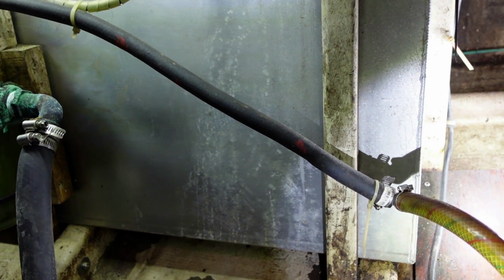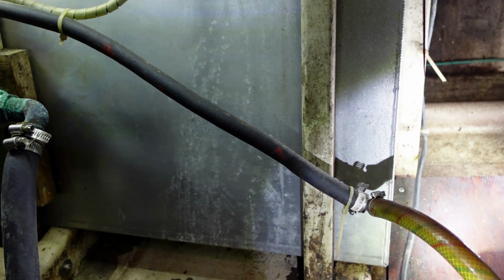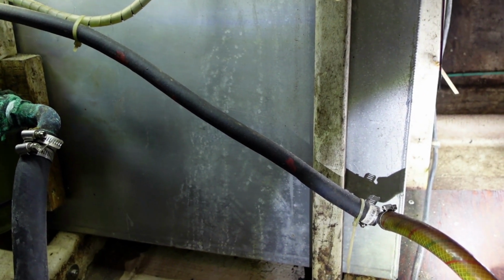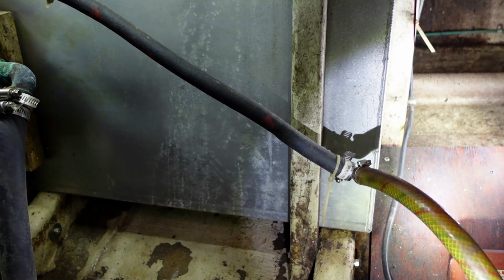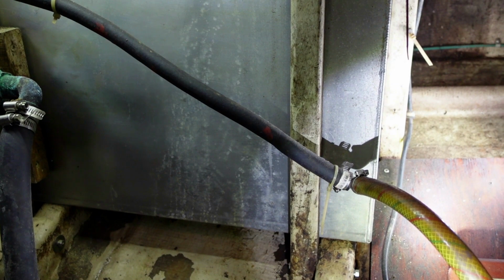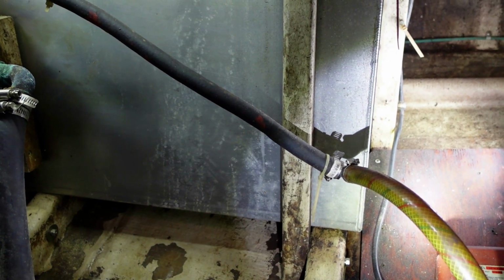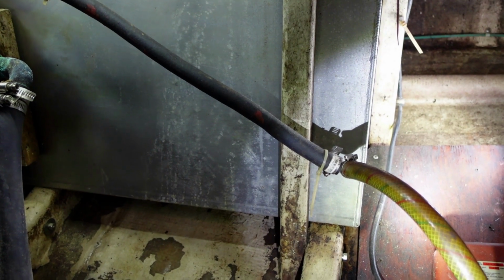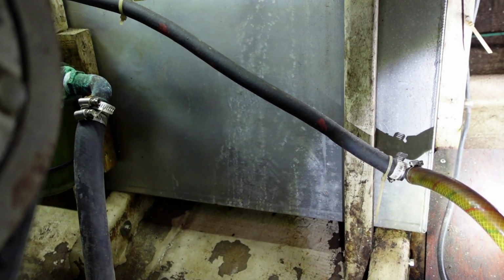So I think for a long time this tank had water in it, and almost certainly has microbial growth, and who knows what else it has in it. When I put the borescope in there, I was able to see a few things here and there that certainly aren't supposed to be in a fuel tank. It's hard to make out what it is or the size of it. A borescope always makes things look very huge when actually a lot of times they're very small.